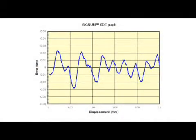At most speeds, you don't see the raw SDE, but an alias effect, as the controller samples the encoder signals, because the sample rate is lower than the frequency of the SDE. Normally, the SDE will be the largest error component.